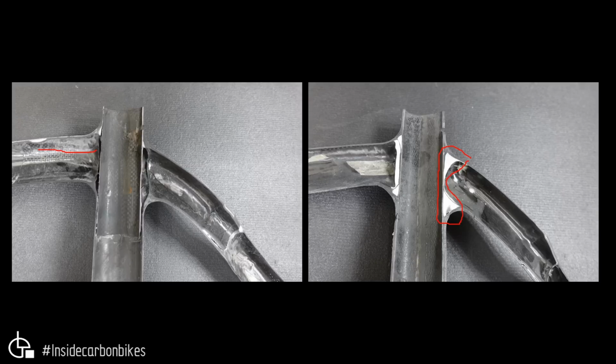So in this case, for this area, I'd rate the Chinarello as being superior to the real Pinarello in the way that seat junction is put together. Now the seat junction is often underestimated in terms of its load, the way it's loaded, and it's actually quite a high stress area of the bike. If you hit a pothole at speed while in the saddle, you actually put a lot of load through that area. So that's something to be aware of. But yeah, on the score I would lean towards the Chinarello at this junction.